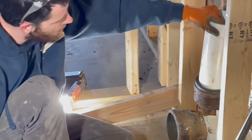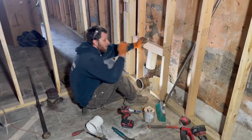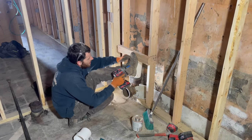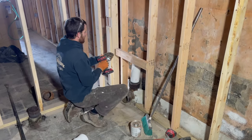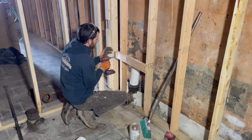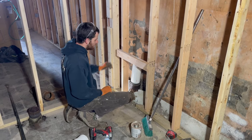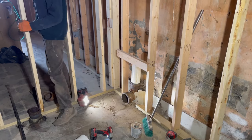We've got our piece nice and beveled about an inch up — all I'm doing is beveling the pipe to make it a little skinnier so it fits into the hub better. I'm going to put a piece of two-by-four here so I can take a tunnel bar and leverage off it to push the piece in. Rich might need to give me a hand — sometimes it takes two people. Sometimes you've got to do it by muscle if you don't have something to leverage off of.